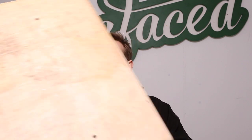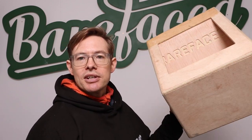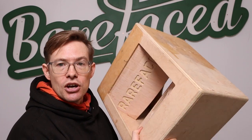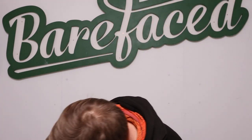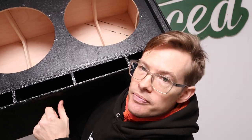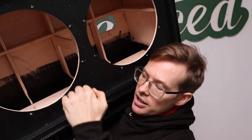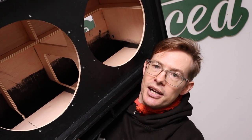The tuning frequency is determined by the Helmholtz resonance. The Helmholtz resonance is an air mass on an air spring. The air mass is the air that basically thinks it's in the port — it's the air mass acting as though it is within this slot. It isn't a clearly defined slot port like on that bass cab. You see it's really obvious with this — you've got these port segments. And if you look inside, that is the port shelf. You can see the port shelf is the unpainted bit there.